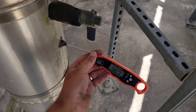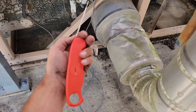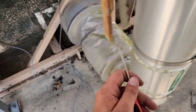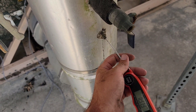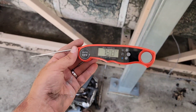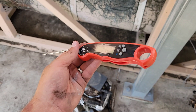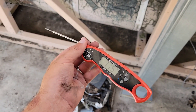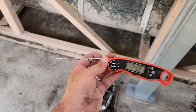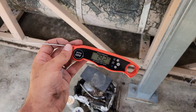I do want to point this out — this is an amazing little thermometer. They're like 10 to 12 bucks on Amazon. All they are is a little meat thermometer, but what's special about them is they've got this special needle-point tip. That fits perfectly into a Pete's Plug gauge port. I highly recommend these — I'll go find some and link them. I usually buy several at a time. They're cheap and easy to replace. I use them on everything. They're super easy to calibrate and I've had really good accuracy. Going into a Pete's Plug, it's just an incredible benefit. I absolutely love this little thermometer.